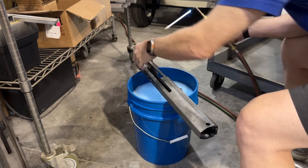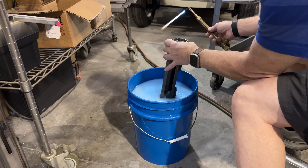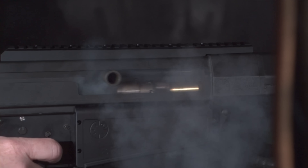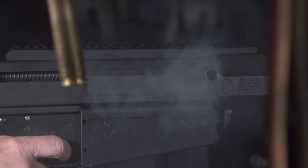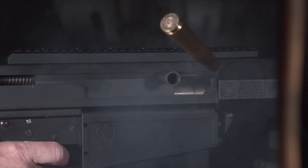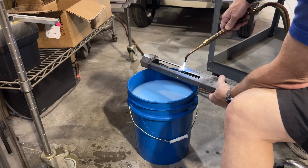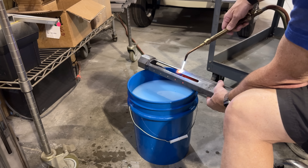The reason I'm doing this is this sheet metal part of the receiver — when these big .50 cal cases come out, they hit that edge right there and they'll bend it up, they'll ding it up unless you harden it. Because even though this is really good alloy steel, it's not in the hardened state, so it doesn't have a lot of strength. So we just heat treat it. And this oxy-acetylene torch makes quick work of it — it's 15 seconds and that's enough.